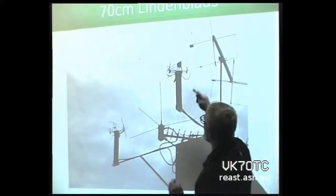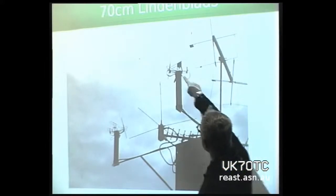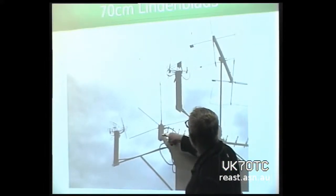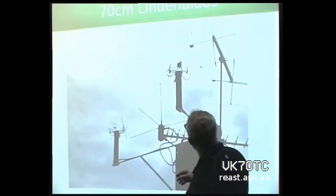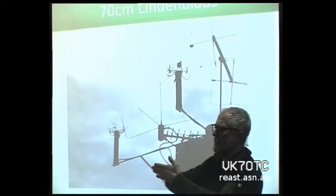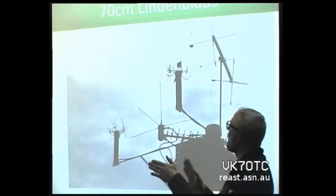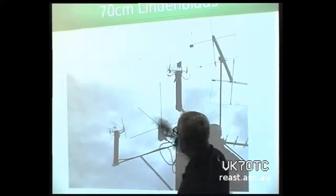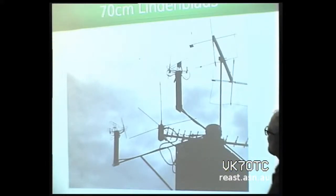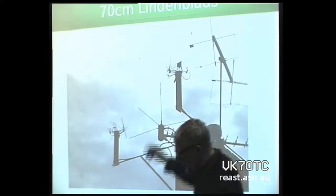Question, Justin, what's the vertical bit? No, on the antenna itself, the vertical bit. What looks like a portaway. The folded dipole here. No, there's a vertical section to it, about a quarter wave. It's the angle of the photo. What you've got is four dipoles at 45 degrees that are 90 degrees to each other. Oh, so what looks like a vertical one is just the angle you're looking at it. One of them end on. Yeah, the other one's got the same thing, isn't it? Yeah. Okay. So, Lindenblads, worth a look if you're into that.